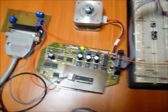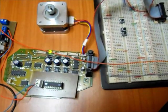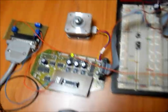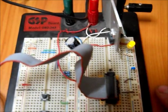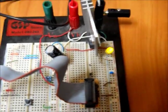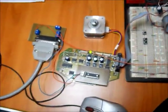I had lots and lots of problems developing this. My biggest problem was not connecting the earth from the laptop to the power supply — it must be connected, it drove me crazy. As well as I had a faulty cap on the 5 volt supply which progressively became worse and did all sorts of funny things. Alright, let's show how we got this far.